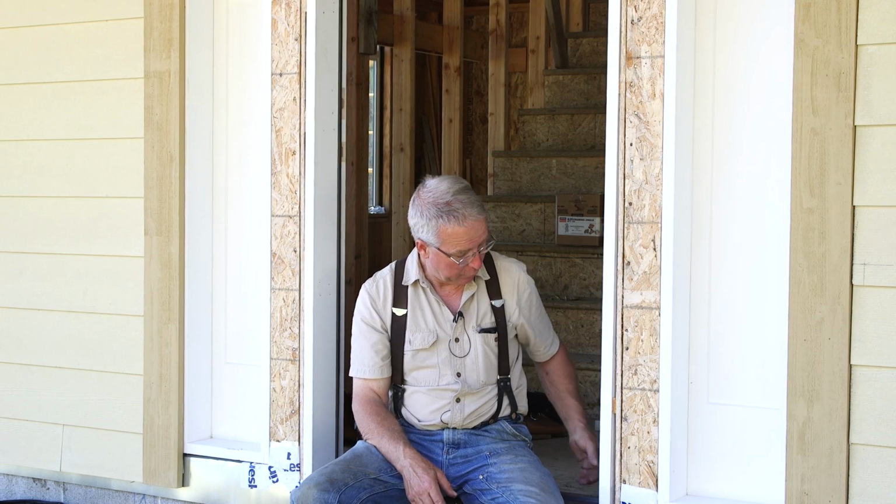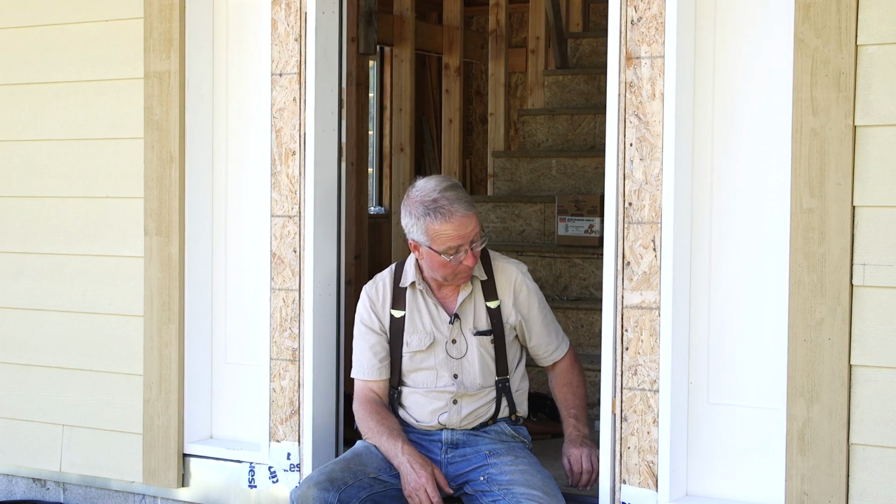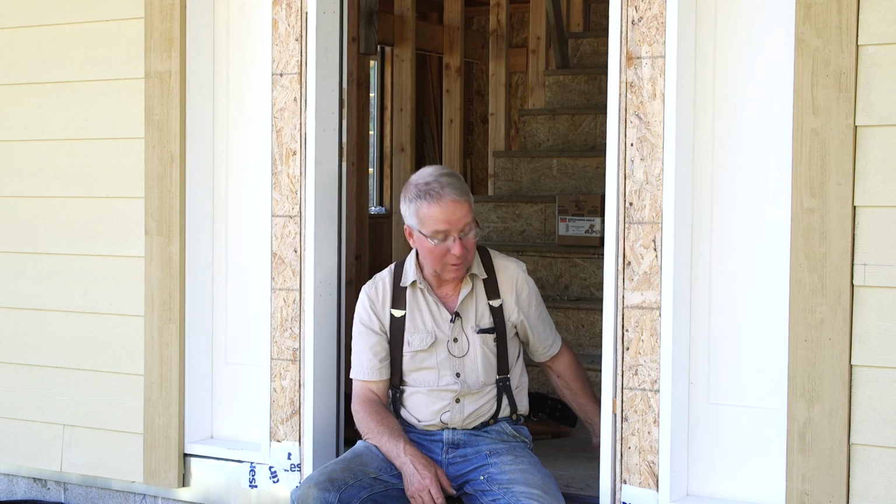I mean, maybe not. Depends on where you are. You might get the whole thing taken care of for, let's just say it doubles the door and you're in there at $3,400. Maybe. I wouldn't be crazy about taking that job in a remodel situation, because who knows what you're going to have to do on the flooring, where the new threshold interfaces with the existing tile or the existing hardwood floor, and so these things can grow.